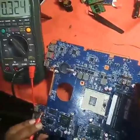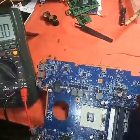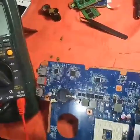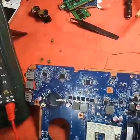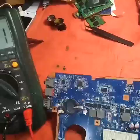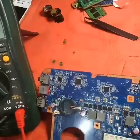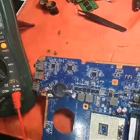The drain of the upper MOSFET is showing zero, and another MOSFET source is also showing zero. That means my VIN line is shorted. Let me check with the capacitor — this is also showing short. If I am getting zero-zero, that means it is ground. If I am getting zero-zero-one, that means it is a short. It proves that my VIN line is short and every capacitor will show short.